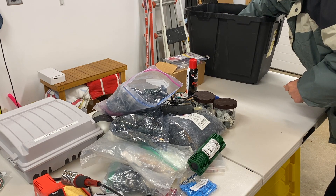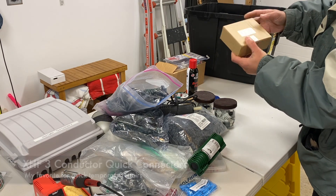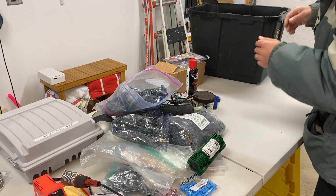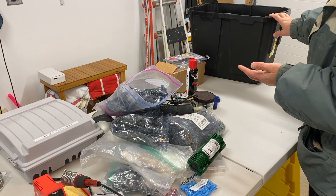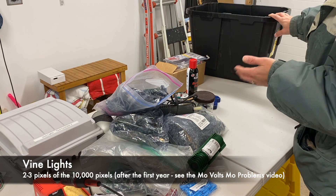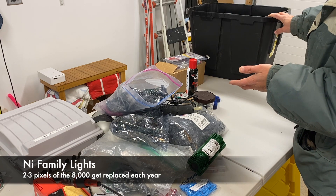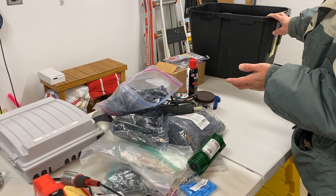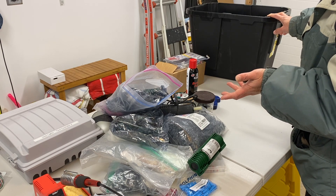At the bottom I have three-conductor wire connectors — I really like these for field repairs. From a pixel replacement perspective, the church show has 10,000 pixels, and each year I only replace about two or three, usually in the first week of powering the pixels. I run the power through the evening for the first week before the show actually starts and run some tests after the week. Those power cycles simulating the show running are enough to ferret out any pixels that will go bad if they've been in storage.